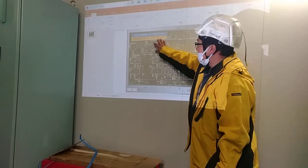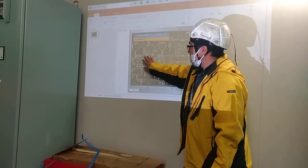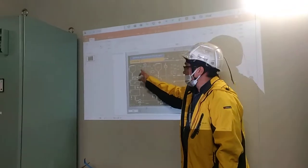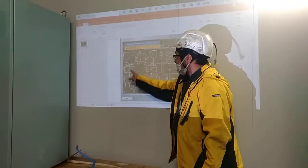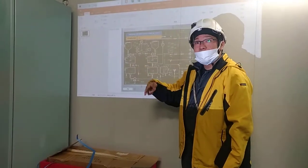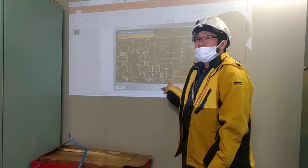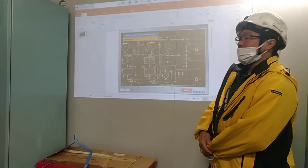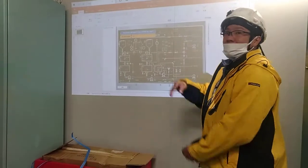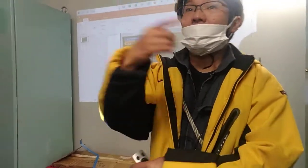Okay, thank you. So this is for ballasting. During the ballasting, we have the neutralizer. Same, we need the fresh water and the neutralizer. It will go here to PW2, it will mix, and then the solution will be ready here. And then we can proceed for deballasting. Okay? So we're clear now with this chemical? Yes. Afterwards, we will see that also during operation.